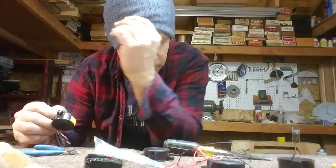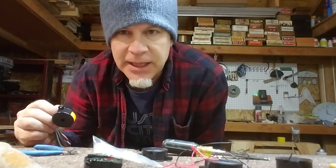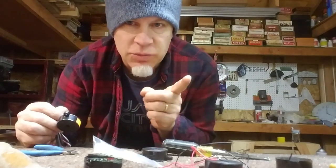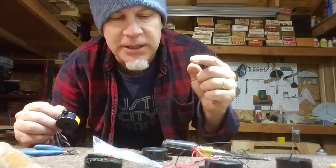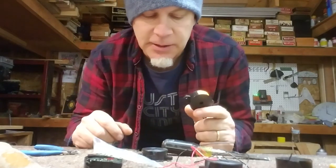It makes that sound when you burn the cake. If you just apply a voltage to that thing, the frequency of the voltage is the frequency that it'll buzz at. So if you reverse wire those things, any kind of vibrations turn into electrical current and you can put those to your output jack and then amplify it.